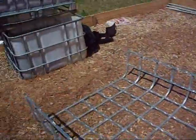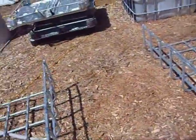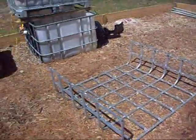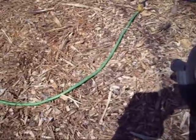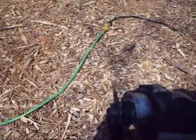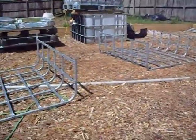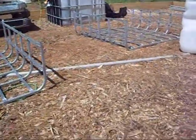Here's how I'm cutting these up. You can watch many videos on how to cut the frames of the IBC totes up, but just measure, decide where you need to cut them off at, get a grinder with the thin metal cutting blade on it, and go to town. Just get a decent grinder — I need to get a better one. Use the thin metal cutting blade, not a grinding blade. Cut your frame up, and then if you want to get rid of the burrs and edges, put a grinding blade on or get a file and knock those off for safety.